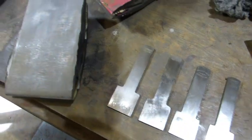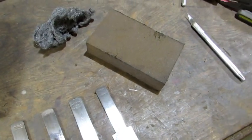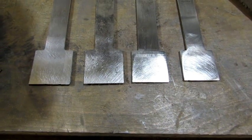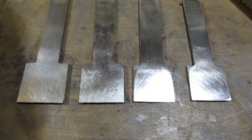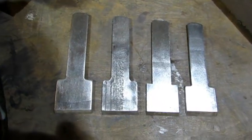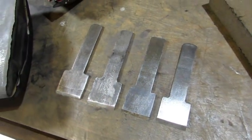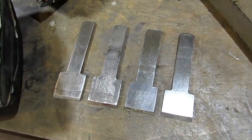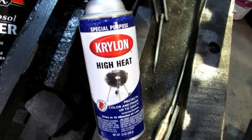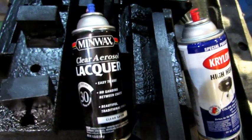The front sides cleaned up really well with just 150 sandpaper on my rubber block, finished with 3000 grit on another rubber block. The back side used the sanding sponge and some steel wool. I've done the initial lapping on the leading edge — you want that back side to be perfectly flat. I've done several other videos on sharpening block planes, so I'm not going to go through the details here.